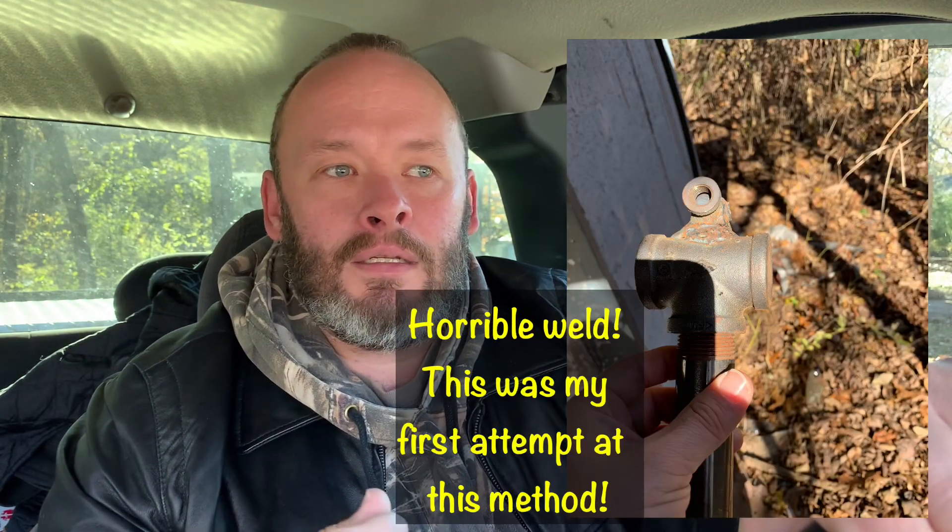The little forge has already worked. I can show a picture of it — in that picture you'll see me using an oxy-acetylene torch actually run with oxy-propane, but I only had the propane side on as my burner. Since then I've upgraded to an actual tee where I drilled through. My coal forge is probably the cheapest you can build — just scrap material. I used the end of a pressure tank from a well as a dish, welded square tubing onto it, drilled some holes, heated up one end of the two-inch square tube, and pounded it out on the horn of the anvil to get it round enough to fit a blow dryer as my air supply.